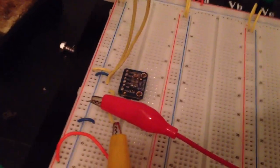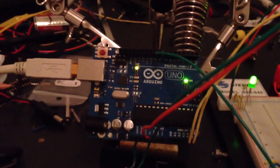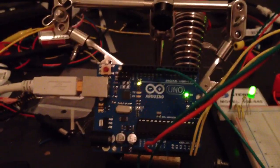And realistically, I couldn't, because the Arduino can't tell the DAC here to go any faster. It's talking over I2C, and there is no kind of burst mode for I2C on Arduino, no matter what the model, it turns out.